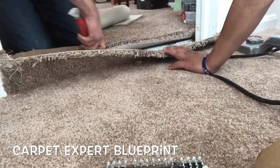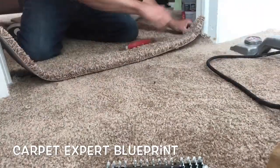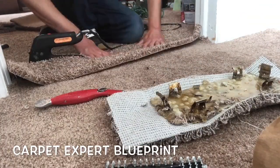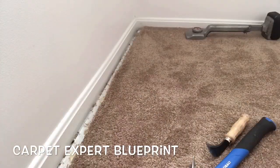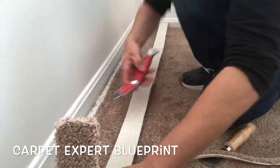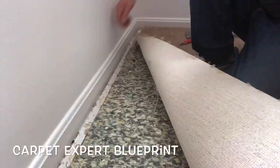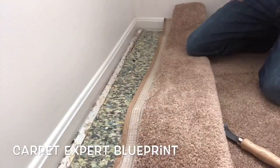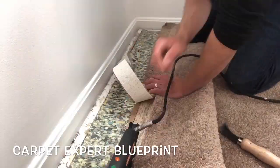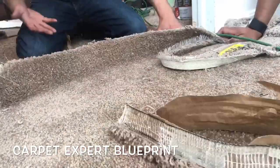What do we have here? Oh, this is repair central — there was a dog that just went ham on this house. Here's a seam where the dog made too many holes in it all the way across, so we're going to do a saddle seam in it. I'm plugging the one side on the one carpet, seaming that in, getting it nice and tight. Here's a part where he pulled it away from the wall, so we're just going to do a little ugly patch seam in there, rough cutting everything in so it looks good. The piece fits kind of, sort of. Now we're going to flop it back, drop the seam tape and melt it on as we go, tractor it all in, and then stretch it in when it's done.